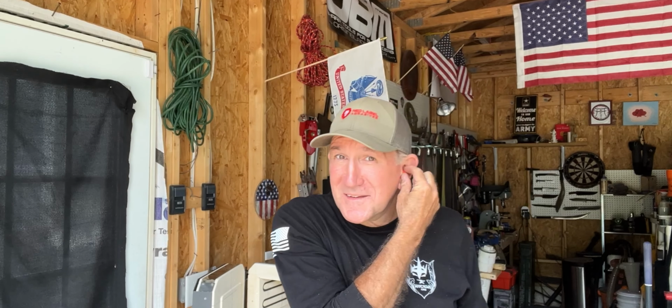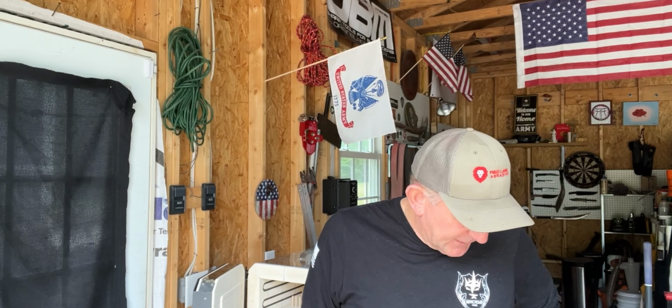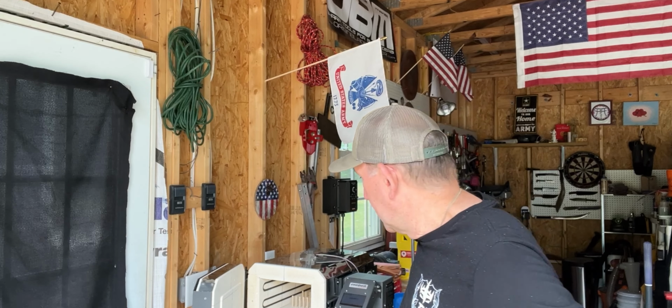So let's get these out. Been grinding in the meantime, working on shaping out some basics on my son's custom knife with the angle grinder, just getting that down to a workable size, and I got that where I want it. But what we have going on, we went ahead and normalized the steel in our dagger set, the railway spike dagger set. I also have a little scalpel knife that I've been working on the side. I've got that one done as well.